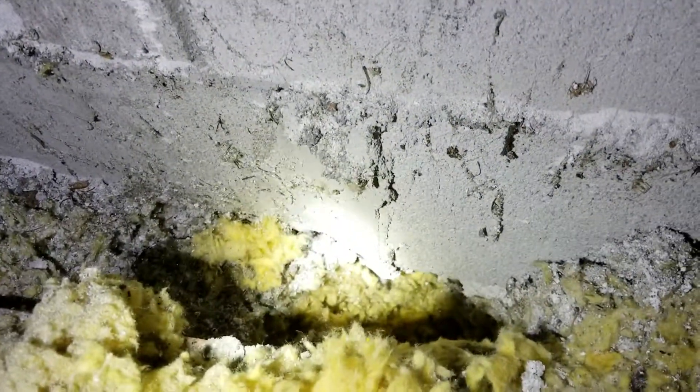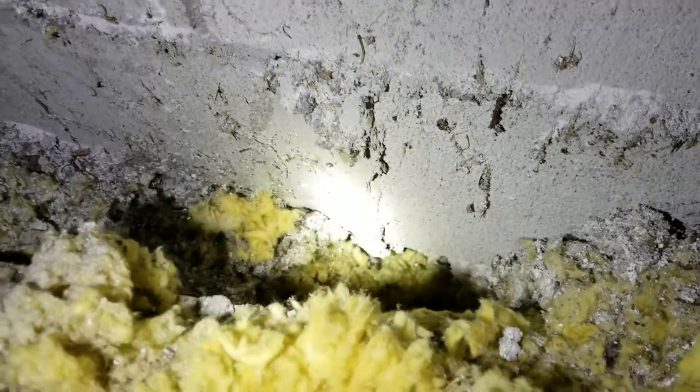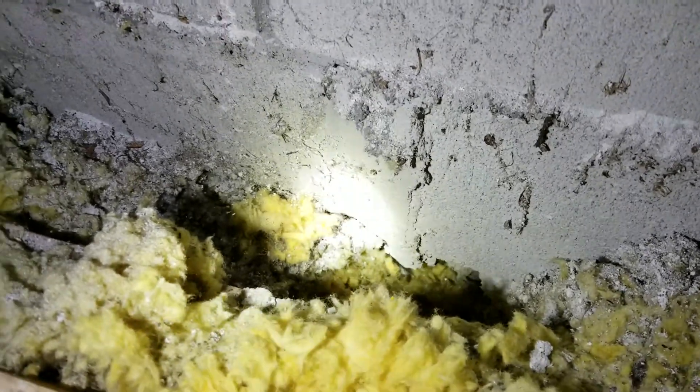You can see how it's all black — that's air traveling from inside the house up through here, which carries heat as it shears off the sheetrock up into that space and then upward. So we have air that is convecting up through the fireplace cavity.